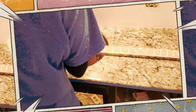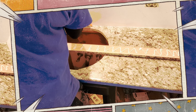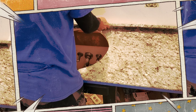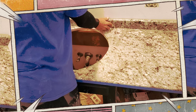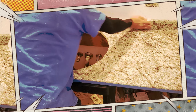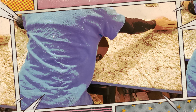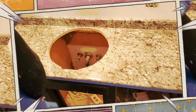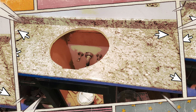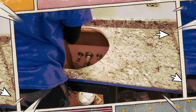Now it's time to put the backsplash in, but we're doing it in glue? That almost doesn't seem right. Well, it's not just regular glue — it's construction adhesive designed specifically for adhering to the wood and the drywall in this situation. It's going to make for an excellent bond and it won't go anywhere once it sets up. It may be necessary to secure the backsplash against the wall until the adhesive has time to set up. To do this, use scrap pieces of wood to push against the backsplash and secure the front of the piece to the cabinet using a clamp.